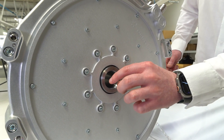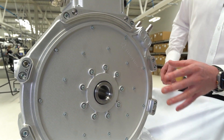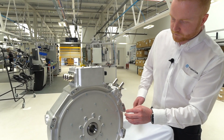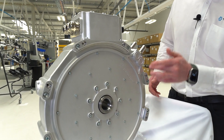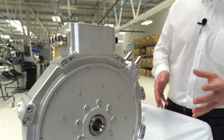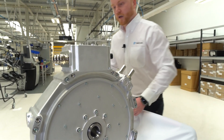Within this circular feature is where the female spline would be sitting. We have a fully bolted and sealed cooling system, accessed via the hose tails. The features here would be used within stacking — so multiple of these motors can be bolted together by Turntide as part of our build configuration and provided as a package solution.